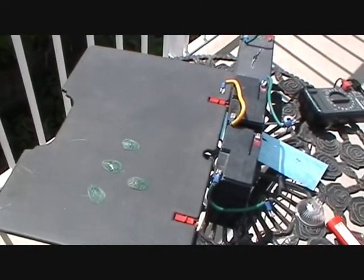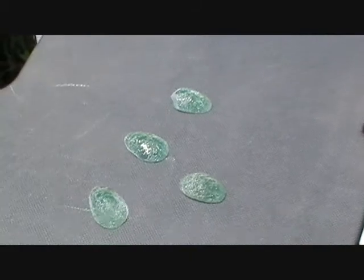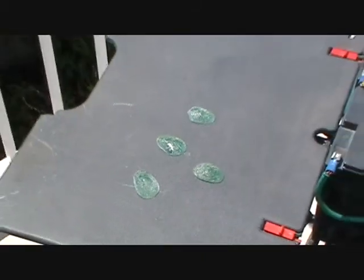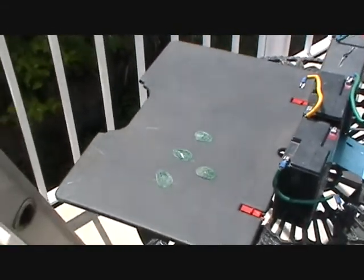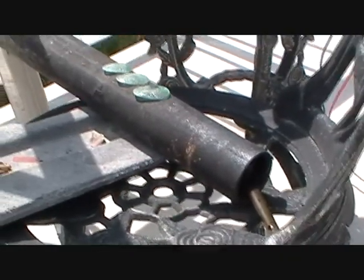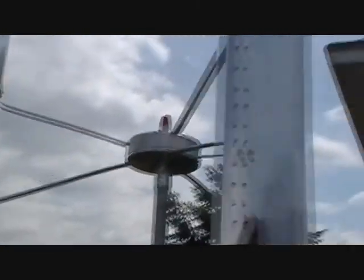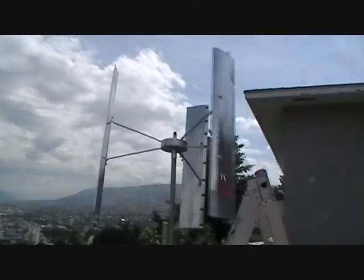This is my little test at solar heating the tubercles I've made to put on my mill. It works — I can force them into a shape, but not really well. So what I came up with was this short piece of black pipe. I lay them out in a row on it and use a torch set on low, just maintaining a nice heat into the inside of that pipe, heating it all the way along so those stay nice and soft. And there they are.